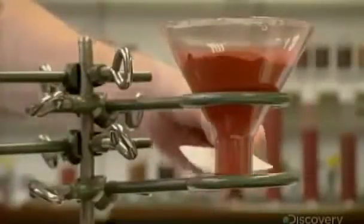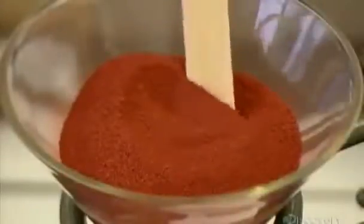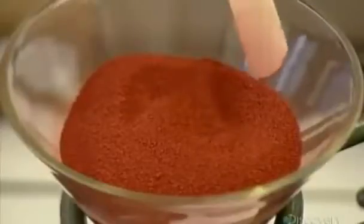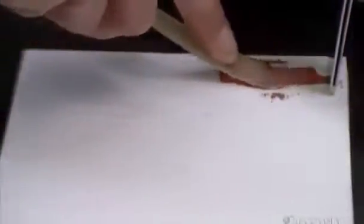The powdered pigment is more clumpy and doesn't flow from the opened end of the beaker. By contrast, the granular pigments are tiny microbeads that flow freely, which makes it desirable for users who want to mix and meter pigments more easily. To test how the pigment would color brick, they mix red pigment with a concrete substitute and compare the result to the standard to confirm that they match up.